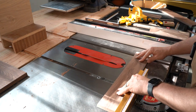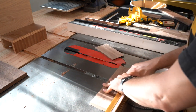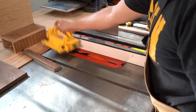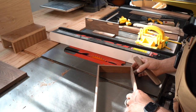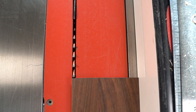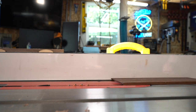The thickness of the box ended up being about a quarter of an inch, which I liked — very minimal, very simple. Then I took that and did a crosscut at 45 degrees on each side, which obviously allows you to make a box. I like to set it up and just check out how it will fit, make sure those angles worked out. I then ripped a rabbet in the end of each piece. The nice thing about cutting those 45s first is that when you do your rabbet, it's not going to show when you put it together — you're just going to be able to drop a bottom in there.